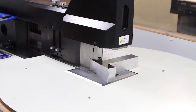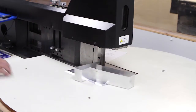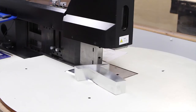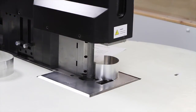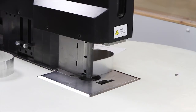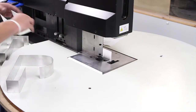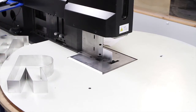As you can see, Delilah shapes returns for built-up metal letters in seconds. The returns can be shaped in brushed, polished and de-scaled stainless steel and even aluminium. Shaped returns can be created for a variety of letter return sizes between 20mm and 120mm in depth.